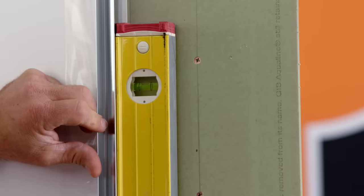If you've found that your doors are only hitting on one end, an easy way to fix that — there's a little bit of adjustment on the screws in both of the doors. You can wind those in or out and that'll move the door left to right accordingly. Now if your shower's got a sliding door, now's the time to install your adjustable door stops.